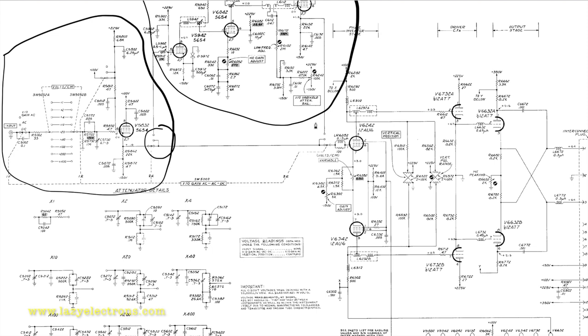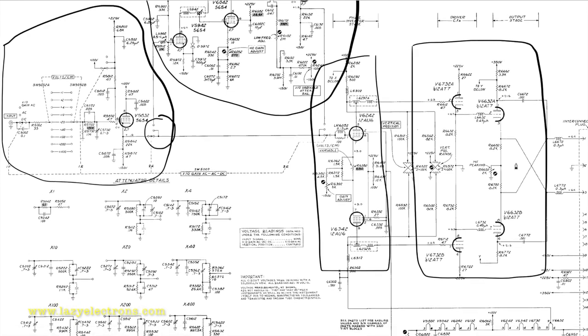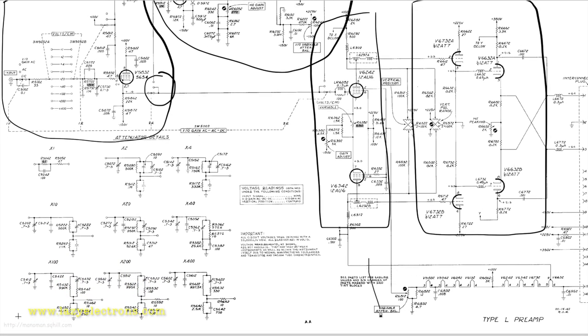So it can take the signal either from the 10x multiplier or directly and gets fed into the paraphase amplifier, which in turn splits the signal into a differential signal and forwards it to the next stage, which is the cathode followers used in the output. There are two sections of cathode followers which are used to drive the output signal. And the heater is directly connected to the DC power available in the plugin, the 75 volt DC rail, which is available to the plugin for powering up all the tubes. As before, the heater is DC power to avoid any sort of interference from the AC line 60 hertz signal.